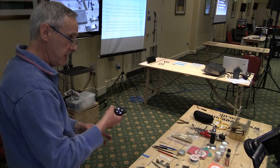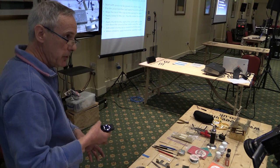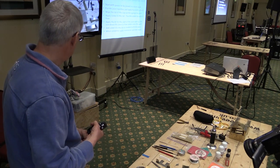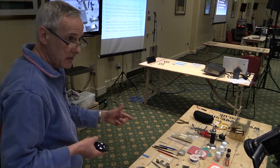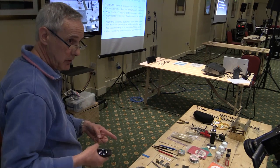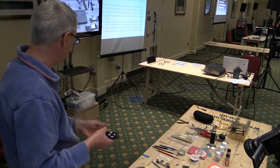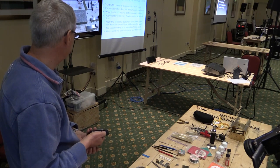If you try and run the iron along the joint without the work having come up to temperature, that's when you get problems, and you get stops and starts and it just won't work. And obviously if you're doing a long join, then you're going to have to add additional solder onto the bit, because you will run out. And then when you've finished, obviously you let it freeze as it cools down, and then neutralize it with some sodium bicarb or neutralizing rinse.